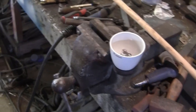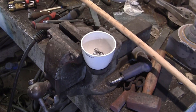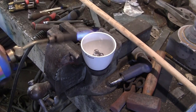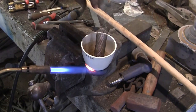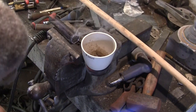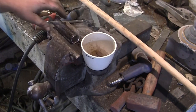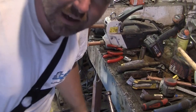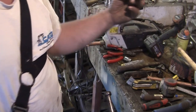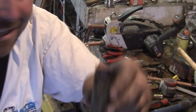Okay, I think this is a slightly more sensible setup. We've got a bit more solder in the pot, we've got a smaller bottom in the pot, so it should be a bit deeper. Much the same, alright. Okay, so I decided I wasn't happy with the soldered screen. What have we done? I've been buggering around. Brass actually spot welds quite nicely to the stainless mesh, so that's cool.